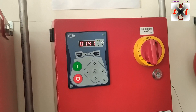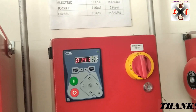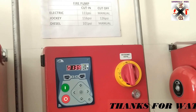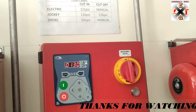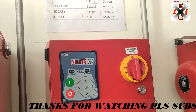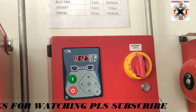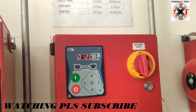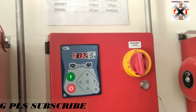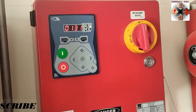As we drain, the pressure drops. I slowed it down so you can see it more clearly. The system reads 116, and the cut-in triggers — very nice. The cut-in and cut-out have both been set correctly, so everything is good.